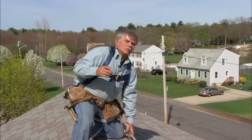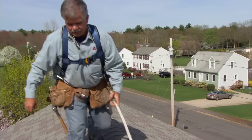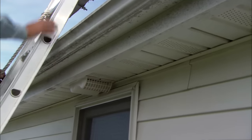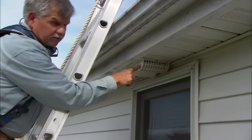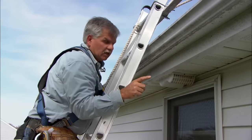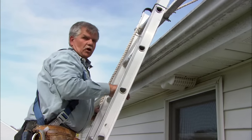Unfortunately, it's pulling more than just cool air into the attic. Back here under the overhang, there's another kind of vent — and this is a vent from the bathroom fan, and it should never be in a vented soffit. It's causing the homeowners a lot of problems.